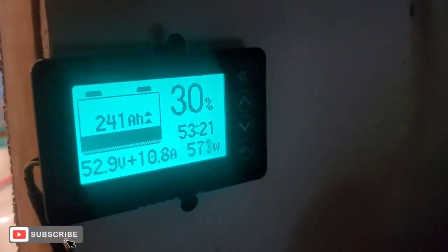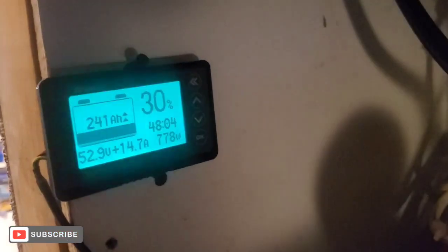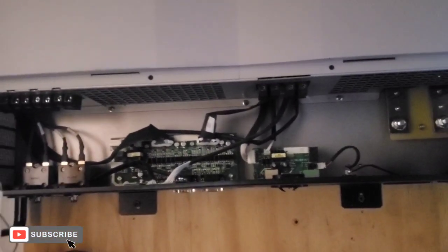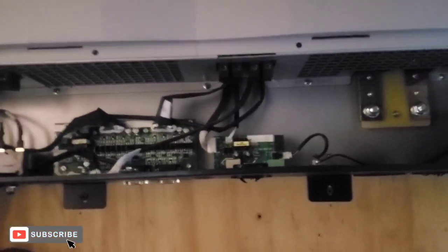I'm shooting this video to show y'all how much watts I was bringing in — almost 4,000 watts. I'm gonna post pictures so y'all can see. I think one reading was 3,800 and one was 4,000. I added the FlexMax charge controller as well — it never hurts to have one of these because I was relying all on the charger inside the MPP Solar and I blew it. I thought it would have some kind of breaker. I was bringing in 160 volts but this unit only handles 140V DC on the solar side.